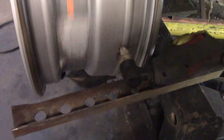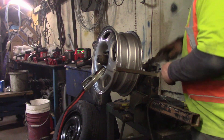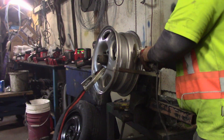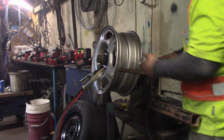This jig I came up with is an old trailer axle — I just put a rim on and spin it, and I can set my plasma cutter right here, turn it on, and cut what I want. I just broke my plasma cutter tip dropping it, so I need to put a new tip on. I'm not going to use basically this section, so I'll make sure I have a good start and go to where I want it. I'm going to cut the back lip off and then the front lip — that way they'll stay on the thing and I can spin it.